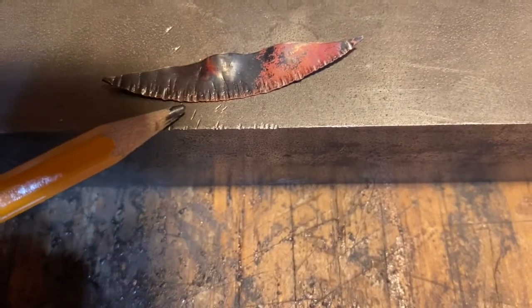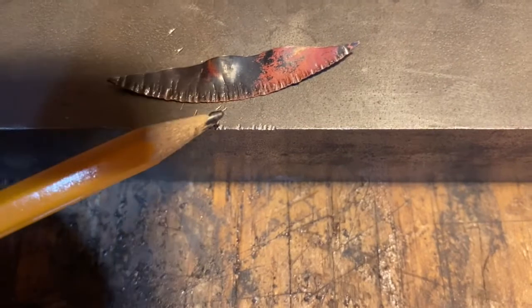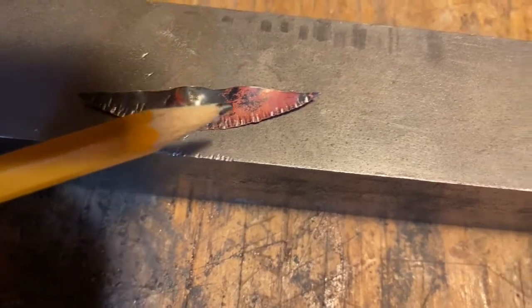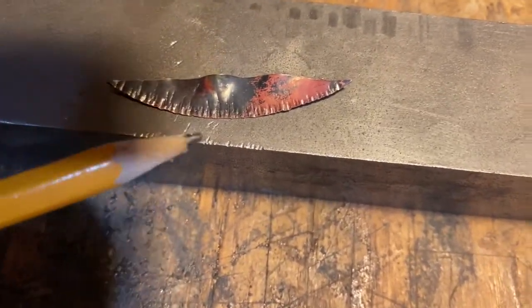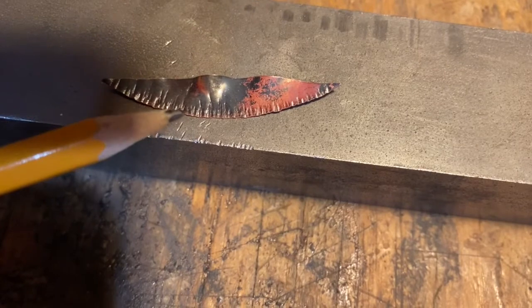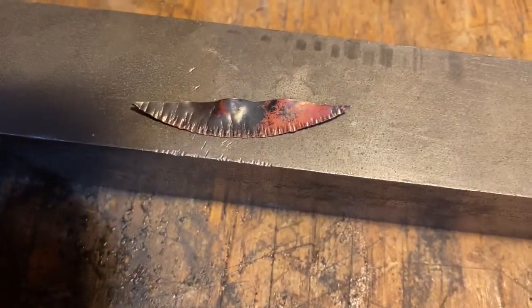That's the folded edge. And that edge that I cut curved is now kind of ripply, kind of straighter. Now I'm going to take the soft blow rubber plastic mallet and flatten the whole thing out and then re-anneal it. But you can see what this is called is stretching. When you hit the metal, it thins it and pushes it and stretches it out, so it's changed the shape of it.